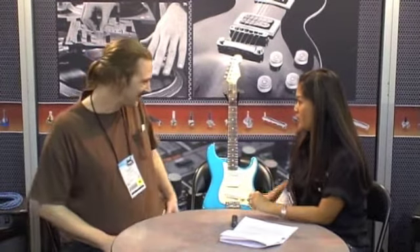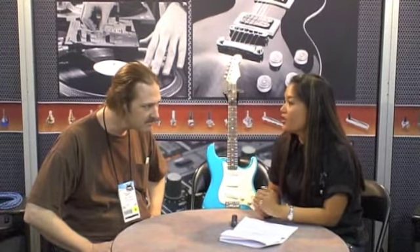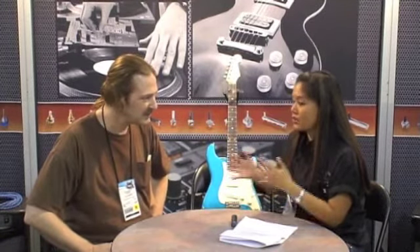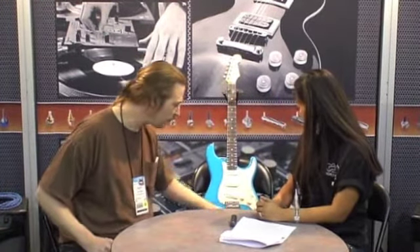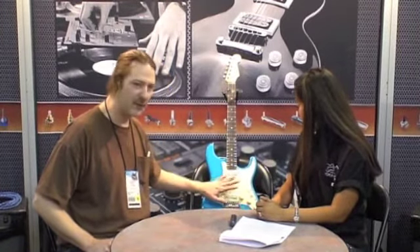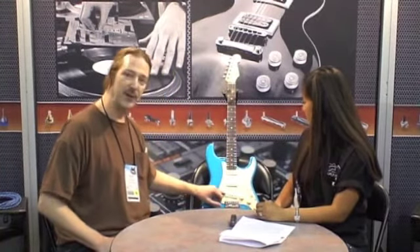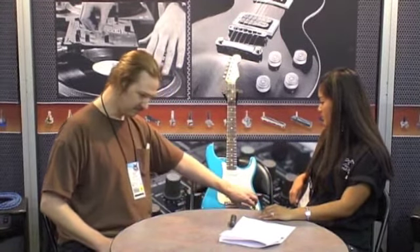You mentioned using the Bourns blend parts, and as a matter of fact, one of your guitars is using our PDB 241 blend balancer parts. That's right — both of them are. How do you go about selecting the parts? Well, actually on this one here, this is wired as a stock configuration would be. So this is the volume, this is the tone, and this is the tone. The twist on this particular instrument is that this also controls the bridge pickup, which it normally does not. And there are two separate voicings for the pickup sets — normally there's only one.